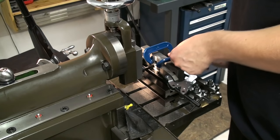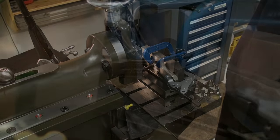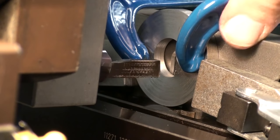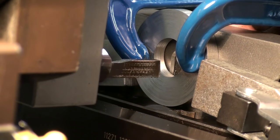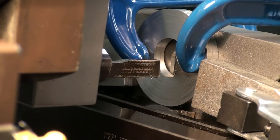The C-clamps are only there so the washer does not fall out. You're looking at the slotting tool in here. This is the washer held by the two C-clamps, and the tool clears through the slot in the angle plate. So we're good to go.